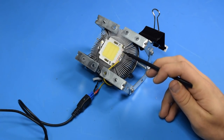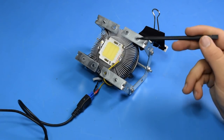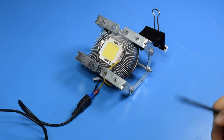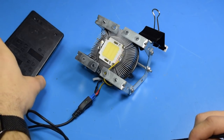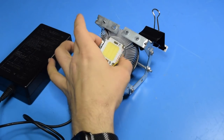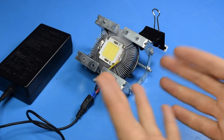We've now arrived at what it takes to power one of these — these are a 32 volt LED. That's not an easy power supply to just go out and buy, since most LEDs are either 12 or 24 volts. However, HP printers have almost always been 32 volts, so I was able to just go out and buy a capable HP printer power supply and connect it to the LEDs. Since this outputs 32 volts and this is a 32 volt forward voltage, I don't need to add any current limiting resistors or any other circuitry — this just works as it should.